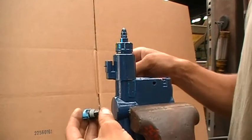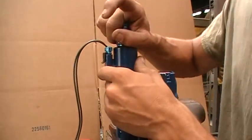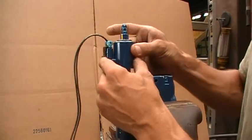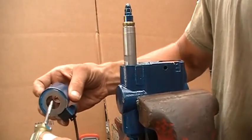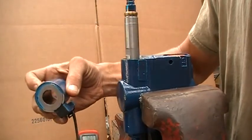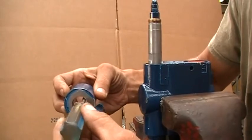If the chain does not engage, the coil must be checked. Once you have confirmed that you have voltage to your coil on your PWM, you would then plug it back up. To check the coil, you would unscrew the nut on the top of the coil, then remove the coil. Don't lose the O-ring. If your coil is working properly, once you energize it, it should be magnetized — it will stick. That will open and close your valve. If your coil does not have power to it, it is not energized, which means it is not magnetized.